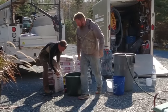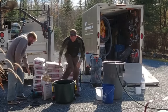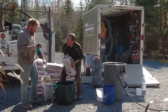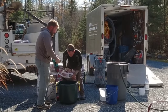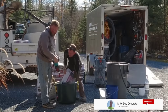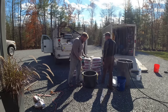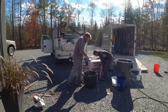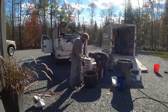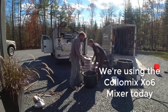That's Jesse on the left — this is actually his house, so he's going to help Darren out with the mixing and I'll be doing all the self leveling and spreading as they dump it out. Make sure you come back for the stampable overlay video. We're going to mix two bags at a time — water in first, then dump one bag in and mix it thoroughly, then the second bag. It should look kind of like pancake batter coming out.